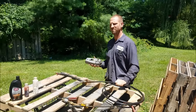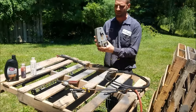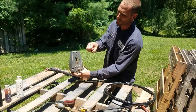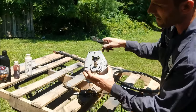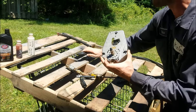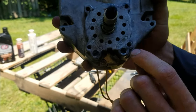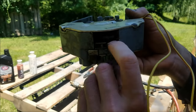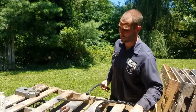These cables are off my boat. I'm not going to show you exactly how to remove everything from the boat — I might do a further video about that. But basically this has both your throttle and shift cable, and when you would put this boat in gear it was very, very stiff. I first removed this from the boat and I can see that the control head is not the issue — it rotates very smoothly and clean. If you are doing boat cables, keep in mind you have adjustments here: a friction adjustment and a detent adjustment which adjusts the ball detent. The point of this video is to show you the technique I use to lubricate cables.